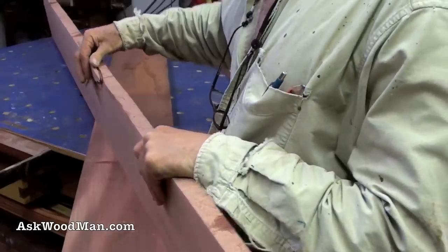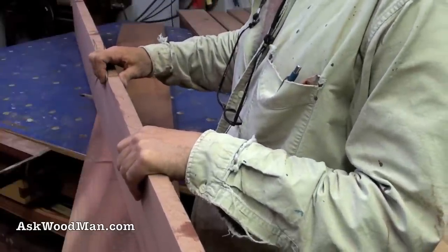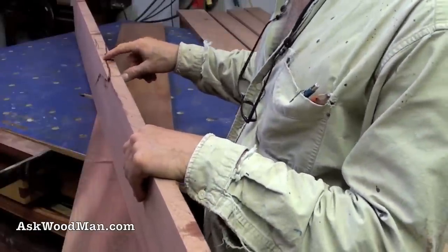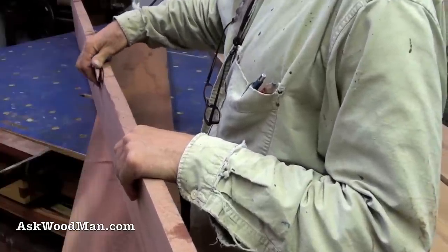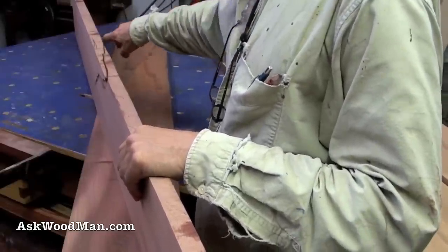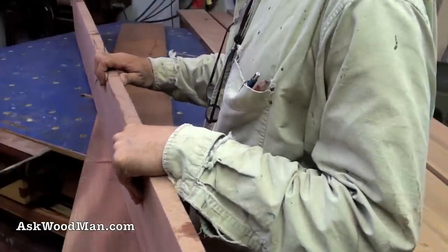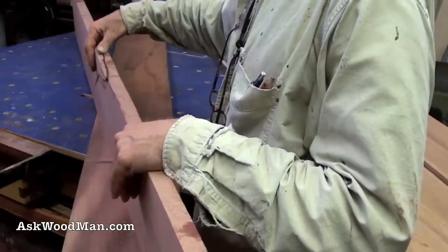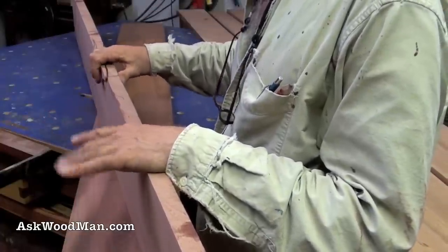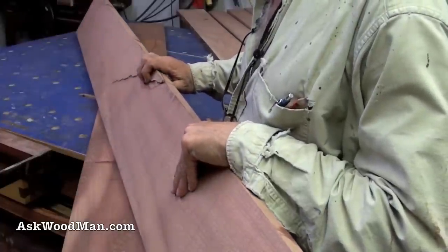This board has such a bad crack that I can see the whole board flexing. I was going to try to have this panel glued up today but I'm not — it's almost six o'clock — because I need to make a structural repair here. I need to get as much glue in here as possible and fortify this joint with wood glue. I can't plane it first and then glue it, so I've got to glue this up while it's still in this rough state.